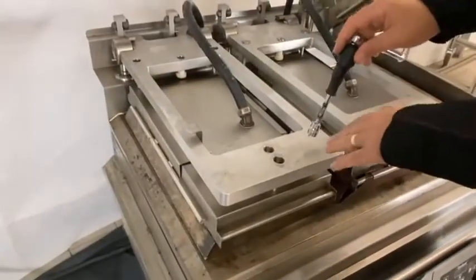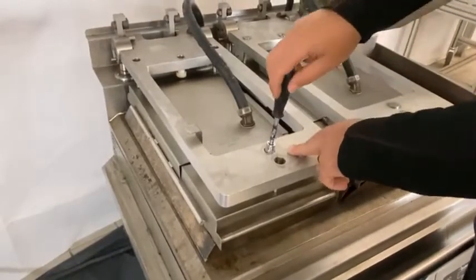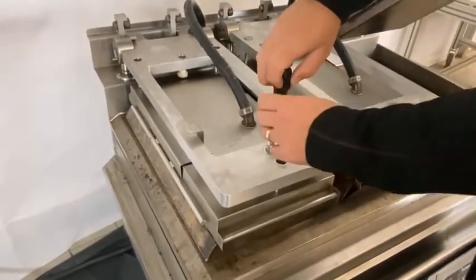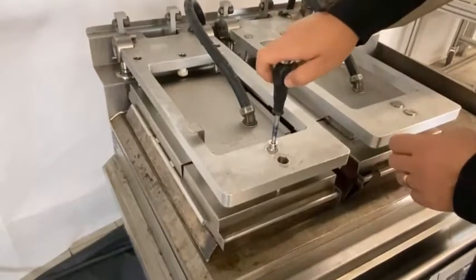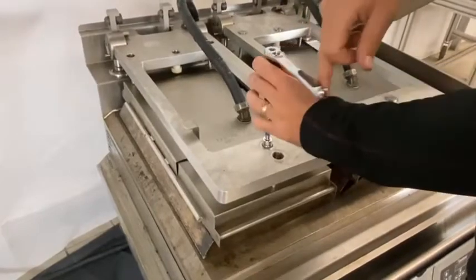The next step of gaping is to set the reed switches. The reed switches are used for product recognition. We're going to put the gapping tool, or the adjuster tool, in, turn it until it's located, and then wind it clockwise until it starts beeping.